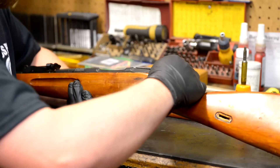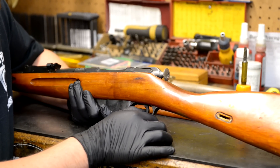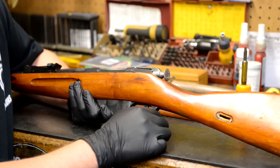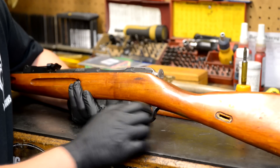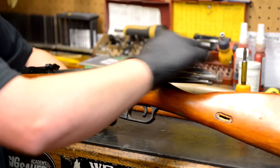Most of the Russian rifles do not have trigger return springs, which we may add one - that's one thing you can do to improve the overall quality of the trigger. In a future video, I will be discussing advanced Mosin trigger jobs. This is going to be a real quick and easy one because it's only going to involve shortening the length that the trigger has to travel in order to get the sear to drop below the striker. We're going to have to take the gun completely apart, so I'm going to go ahead and do that now.